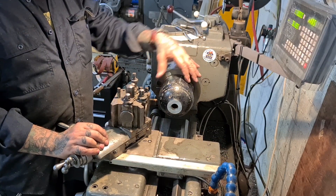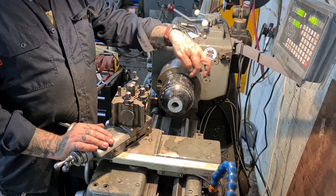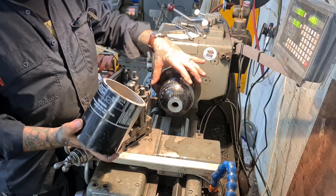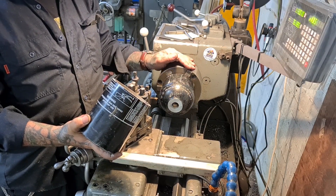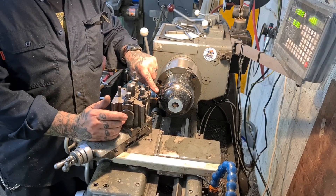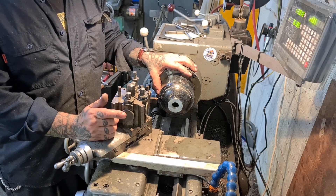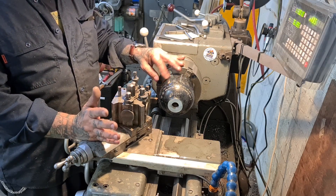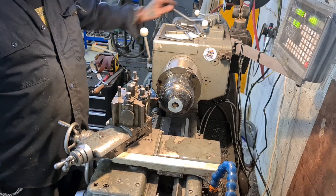I can't get right up to the jaw so I'm going to have to flip them around, put it in a four-jaw to get to this very edge and face it off. I think the three-jaw is too small for it. I can rough out the outside edge, and once I find the depth of cut on this surface I can zero my DRO in either absolute or incremental, save that, and when I put this tool back in and do the other half I can take it back to zero and it'll be exactly the same outer diameter.